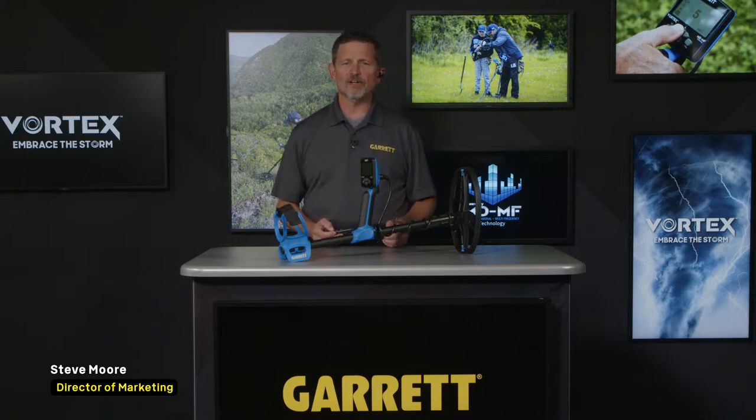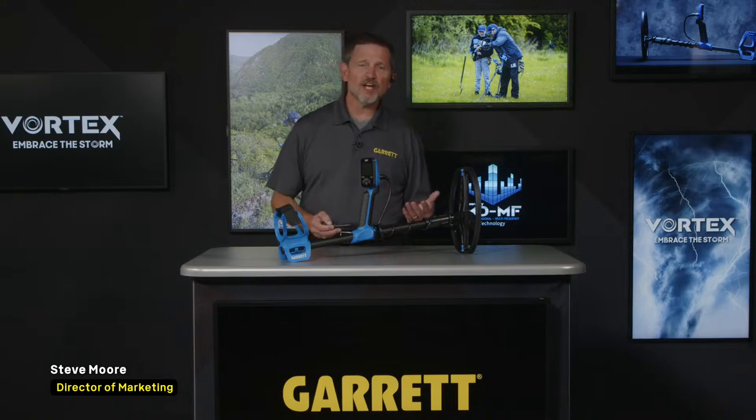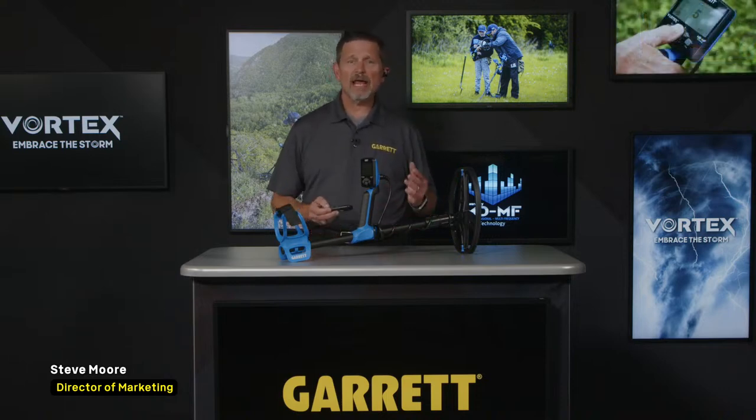The entry VX5 model includes a true multi-frequency mode, as well as a single frequency operation choice of 13 kilohertz. As you step up into a VX7 or VX9, the number of single frequencies increases, and you gain the power of Vortex's new multi-salt mode. This is an all-new multi-frequency salt mode, offering greater depth and target ID, both in the saturated wet salt along the shorelines and in the deeper water as you search the surf. Vortex offers smooth operation with deeper detection and better target ID in wet salt sand than any previous Garrett Beach mode.